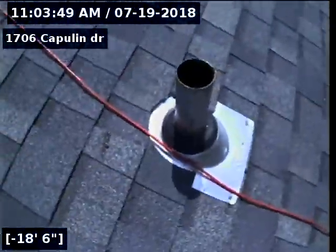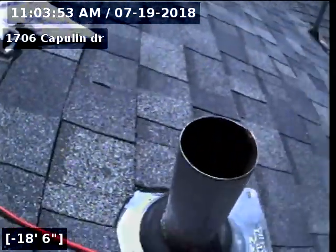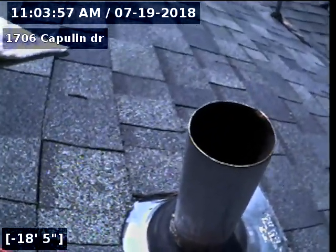Alrighty, that's the end of the video. The line is clear. We did find one crack in the line, and we did find an old Fulton clean out in the front yard as well.